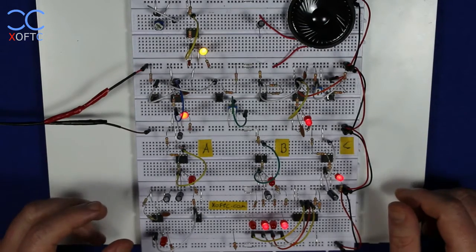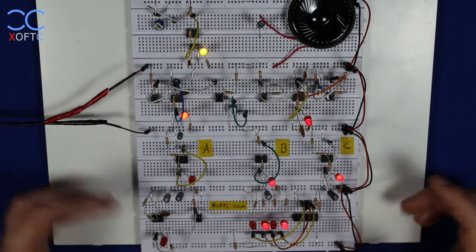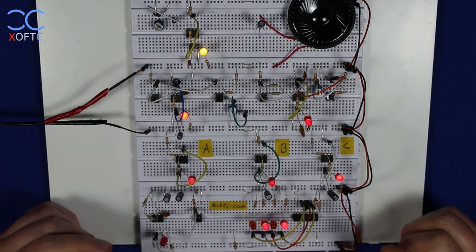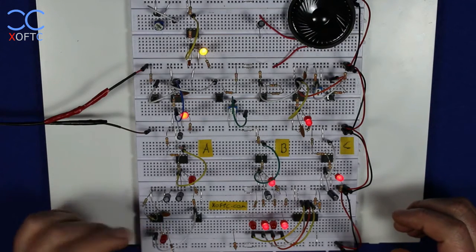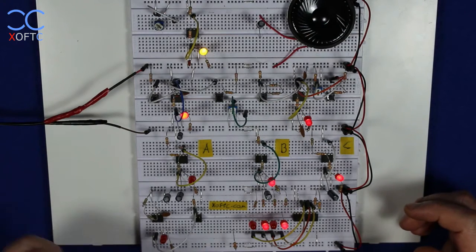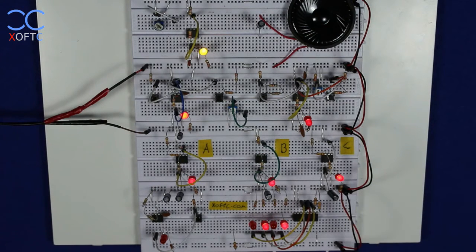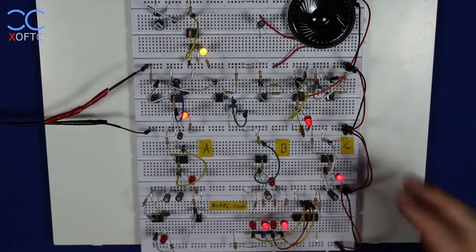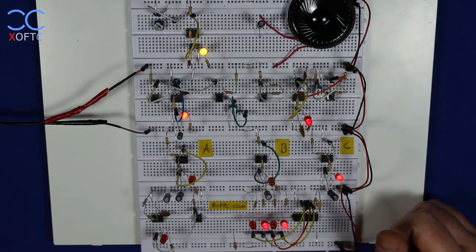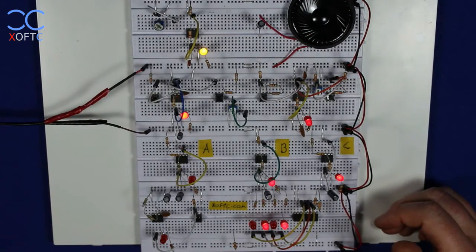I'm going to explain it also later, but to make things simple, monostable mode is basically where the timer will wait to receive some sort of an external signal, whether manually, like pressing a button, or from an external circuit or device that is connected to the trigger pin on it. And only when it receives this input, then it will produce a single pulse, and it will go low and wait for the following input to come in.